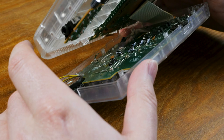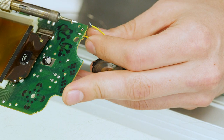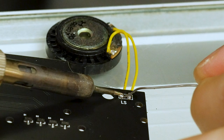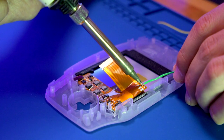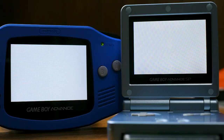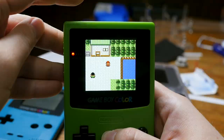But there are a few things you may need to be prepared to solder or at least get some help with. For instance, I got some help from Zack down at Video Game World in Huntersville, North Carolina to get my DMG speaker moved from the system's front board to the new board, which is required for any DMG screen mod if you want sound without headphones. Likewise, certain other mods like for the Game Boy Advance require soldering for adding brightness control to the R and L buttons while holding Select. I decided to forego this to keep things simple and improve battery life — the default brightness on the Funny Playing compares very favorably to the max brightness on the AGS-101, so more brightness is not needed.